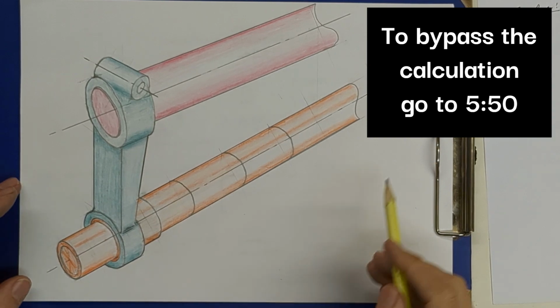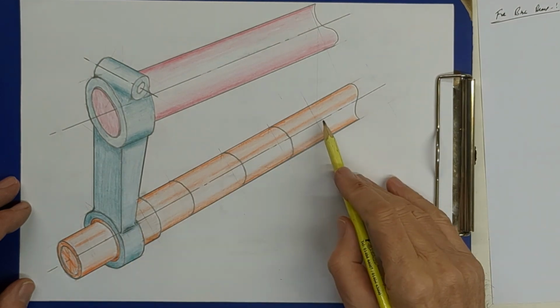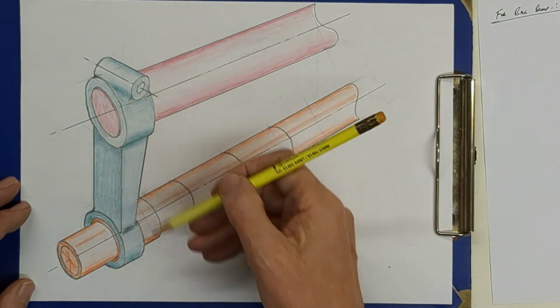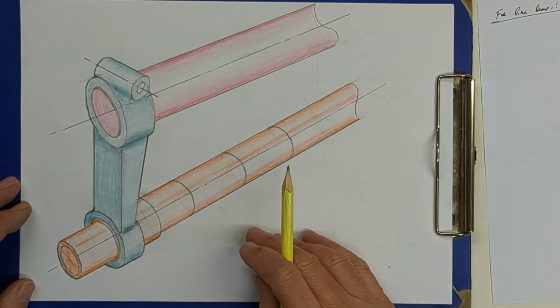So you've just seen the setup there. This is the overarm support, cast iron 2.5 inch diameter beam. This is the arbor, which is in fact a 1.25 inch arbor with the sleeves and the journal. And this is the bracket which we're making. We're going to be machining this today, continuing to machine it. This is cast iron, this is steel.